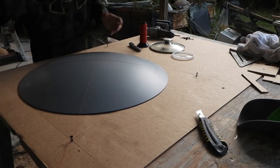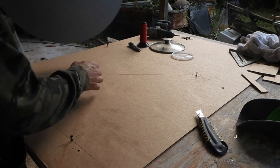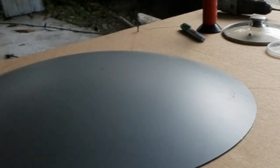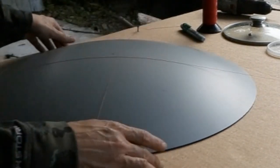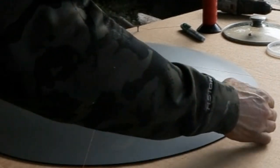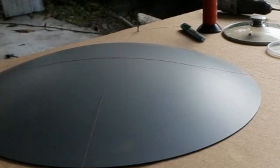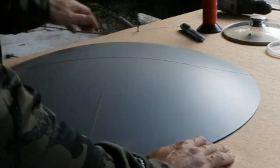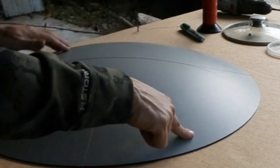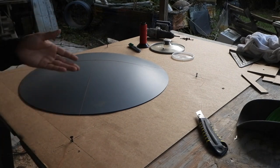So we've got it marked. Now, if you were to measure this with high-end tools, you would probably see that this is the true center. And the cool thing is, if you want to double-check your work, all you have to do — once you've got the strings down, say you're doing a bunch of these things — you just rotate it and put it here. Line it up with everything. Let your strings pop, and they should land right back where it was. If you have any difference in that, then there's a problem with your first measurement. The strings are a little bit flimsy, to be honest. But keep in mind, this is a really difficult object because you've got curves going around it. Flat objects, cutting your own circle — pretty easy stuff. This is the easiest way to find the center of a circle using a square.